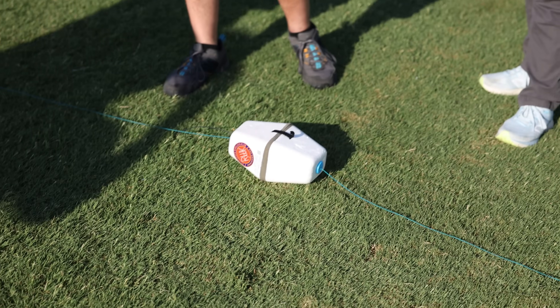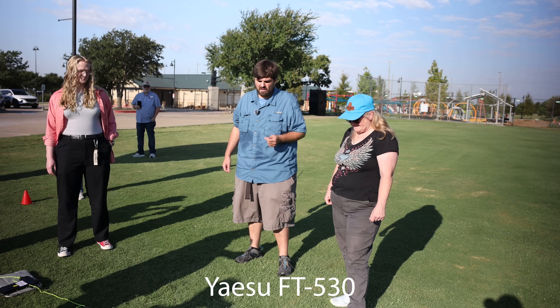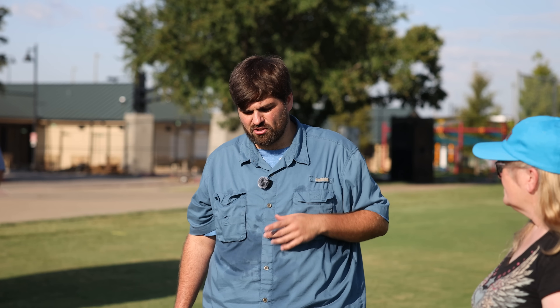This payload is our crossband repeater. There's an old 90s-era HT in there — it's the Yaesu FT-530, and all that does is listen on two meters and retransmit that audio on 440. So we're hoping to make contacts all through the southern U.S. through that box.